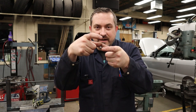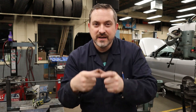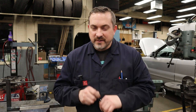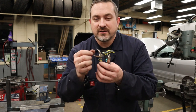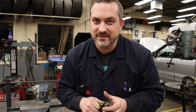Some other chainmail making tips before you head out: when weaving your pattern with chainmail rings, do not open up your chainmail ring outward like this — you'll distort the curve and you will never get it back and it will never close tight enough. Instead, open it sideways, slot it into your pattern, and then close it side to side. Remember you'll go past to get it to spring back so it's nice and flush — you can even close up the gap even more that way. You can do it with your fingers, but after a while it gets hard. I would highly suggest investing in a pair of jewelry pliers — they're tiny so you can get into tight chainmail weaves, and the inside of the jaws has no serration so they won't leave any indents on your rings.